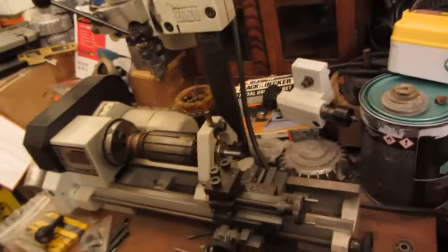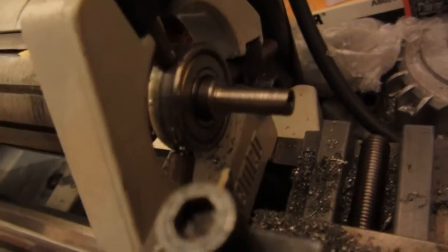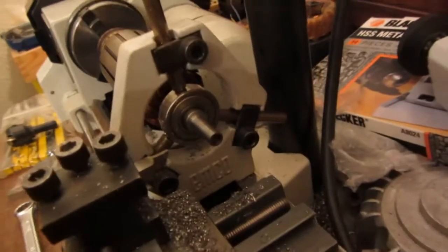This is the supplement to the video I just recorded earlier. I've machined the motor shaft down to exactly dead on six millimeters, and that setup worked very well — holding it in the lathe using the fixed steady.